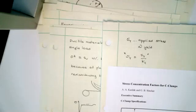You probably won't design anything that's close to rupture from plasticity on a first load. And so using the ultimate strength with yielding for a ductile material as the limiting stress you can have is not too bad. And that's what the book kind of shows. But there are other instances where these things matter just with one-time loading, yielding and brittle materials. Okay, well, that's all I've got for today. Do you have any questions?